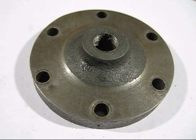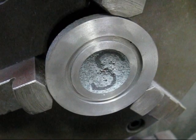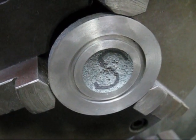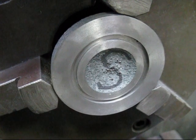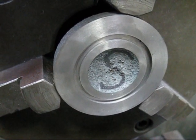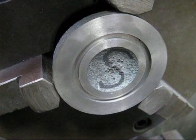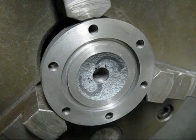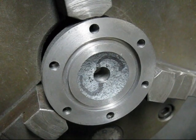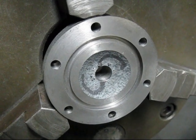That's the second view of the cover, flipped over. This is the cylinder cover — I've cut the o-ring groove in, but it was a lot of trouble. I slowed down the lathe to the slowest speed in the chuck and it still chattered like crazy. All the necessary holes have been drilled, so now I just have to tap the centre hole to put the grease nipple in.